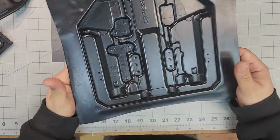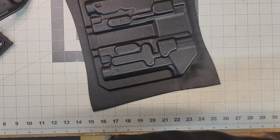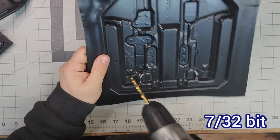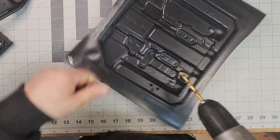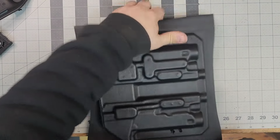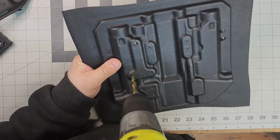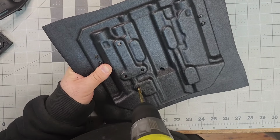Now, quick, easy, drill like normal, and these are 7/32. Let's pop these ones out real quick. Actually, these are going to be the only ones that are 7/32, and this is 0.093 Kydex, not 0.08. So for this, we're going to knock these holes out,